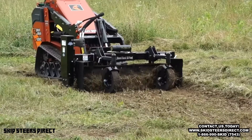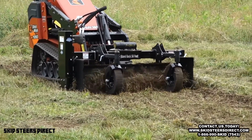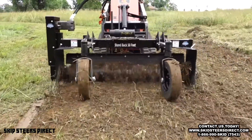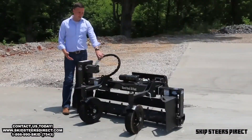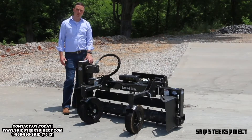This is a seven-inch drum. Now, sometimes when using a motor down low, like some do, it causes you to have to use a bigger drum. A bigger drum is not better — a bigger drum causes more drag and you lose torque. If you use the same size motor down there as up here, you can actually use a smaller drum, and therefore get more torque and have more ability to work harder ground.